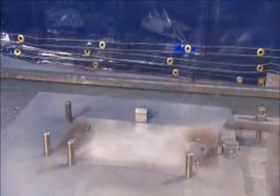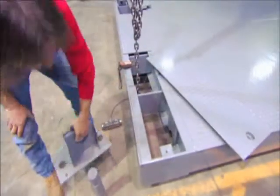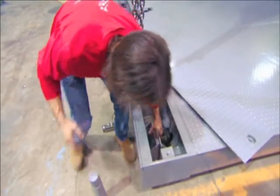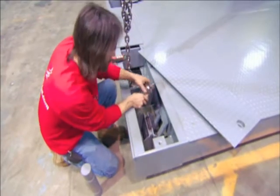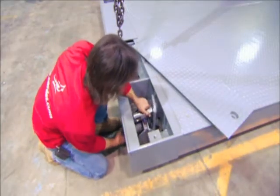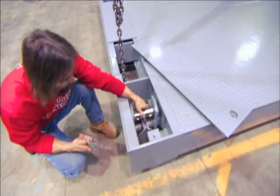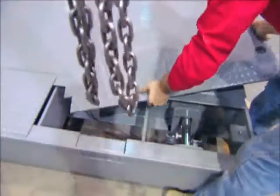Now that all the parts are ready, final assembly of the truck scale can begin. The weigh bridge, right side up now, contains eight load cells at different locations. The first step is to install each load cell stand into its respective position. They insert a link on each side of the stand, position the load cell at the top of the links, and the bulkhead pin at the bottom. Then they close up the location with an access plate.